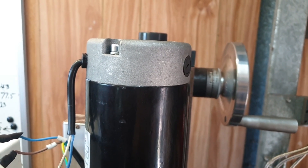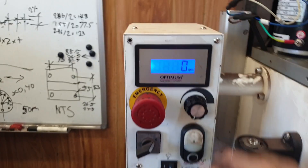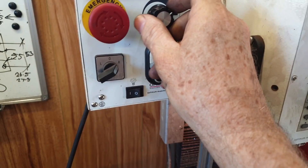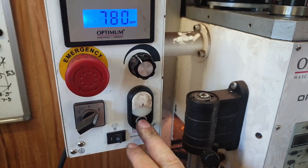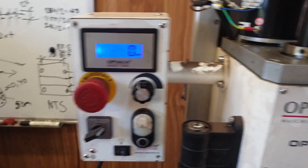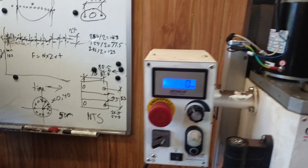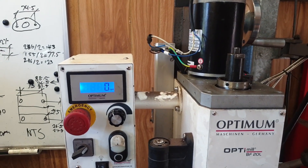It was no longer open circuit. I replaced the spring on this brush, hooked it back up to 32 volts, and it ran. I then tentatively put this back on — zero and nothing at first — but we got life. So it means that the problem was not the controller, which is a good thing because that's running. I will replace the brush in here with a new one because that's fine for testing, but we have life in the mill again.